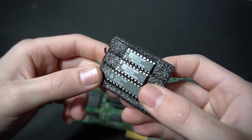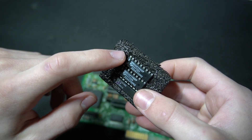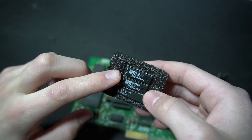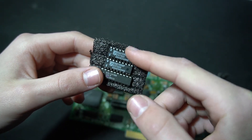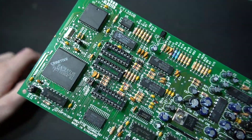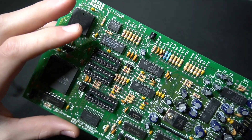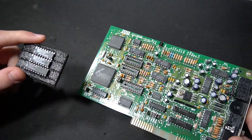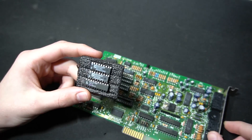As you can see on the chips here they have little notches on one side. That notch is critical because it's the orientation in which the chips go, so we need to make sure they're lined up correctly. Looking on the card, the sockets also have a similar notch taken out on one side, which tells us all the chips need to go in this orientation.